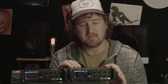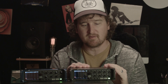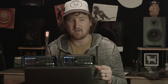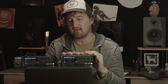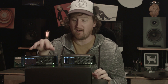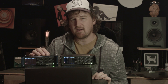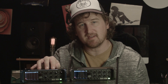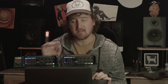I run the external DC in with the Hirose connector, and it's fascinating — in low power mode with the screen turning off after a few seconds, running the Hirose battery, I didn't even turn it off and it lasted eight hours. I lost one volt out of the operating range. I have mine set to shut off at 8.5 volts and it can run up to 15.8. I started the day at 15.8 volts on the F8n in low power mode with the dimmed screen and external battery — eight hours later it was at 14.8. So a good battery with good power saving settings in either of these devices should last a whole day of filming.